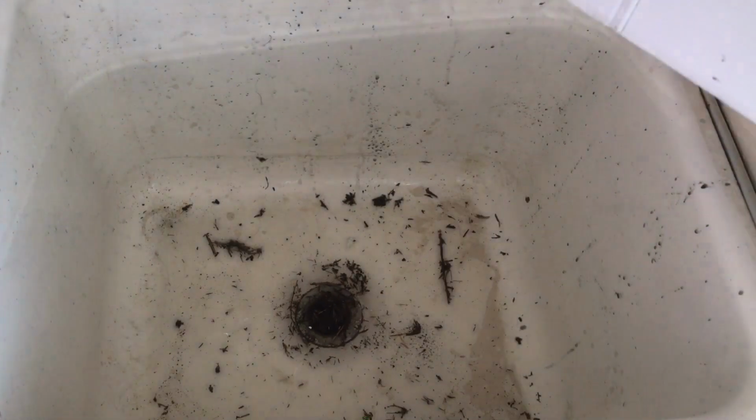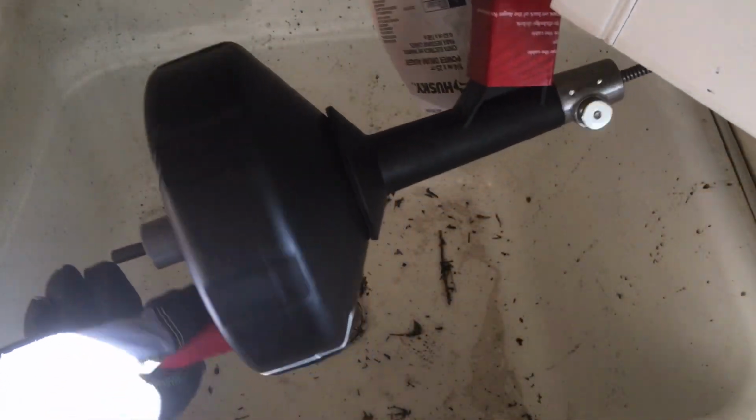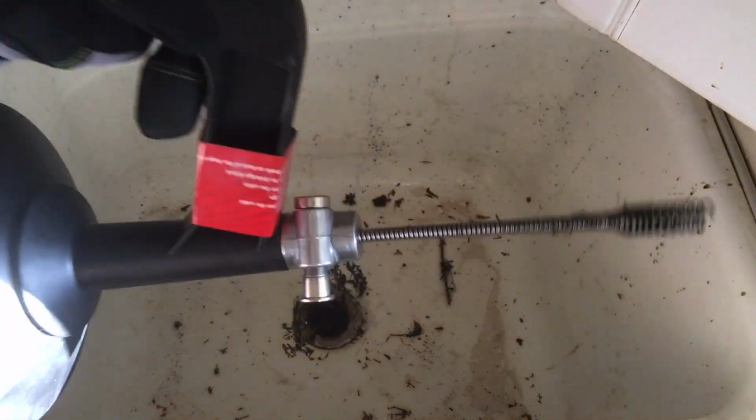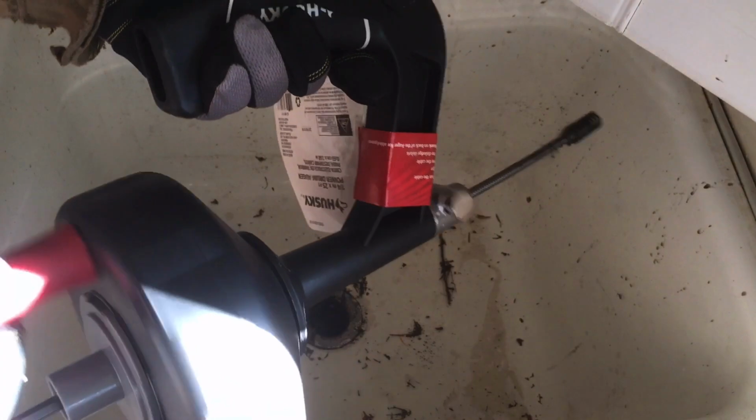I bought a 25 feet drain clean cable. It has a spearhead to poke through and pull out. You just need to spin the wheel, or use a drill to spin the wheel, to make the cable come out. Clockwise to pull out forward and counterclockwise to pull backward. Doing this a couple of times, pull out and pull back, and you're done. It is very simple.